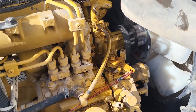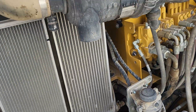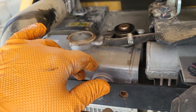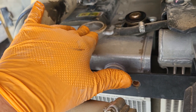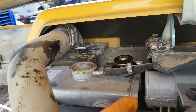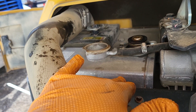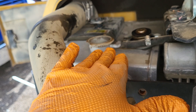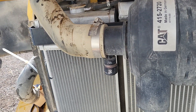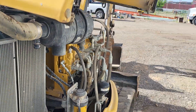Then install your gasket right here and set everything back in the way that it was. What I usually recommend is carrying universal 50/50 antifreeze. When we've got that all back in, we'll top this off with antifreeze all the way to the top, put the lid back on, run it, and test it. You might need to let it cool off again after a minute, pop that cap off, and make sure your fluid levels are at the top.